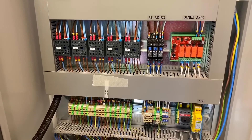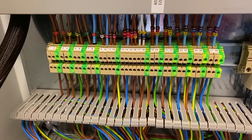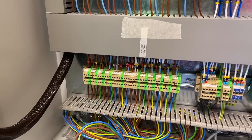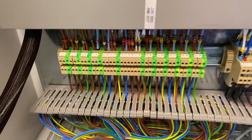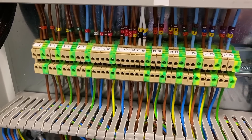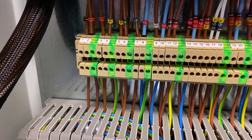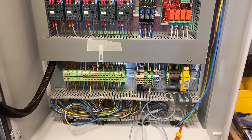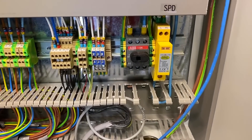What's your go-to method of installing the wiring system? Looking down here I can see our conductors are pretty logical — we've got our protective conductor, line and neutrals together. Have you not thought about putting in a separate earth bar, like we're used to seeing in distribution boards and consumer units, Eddie? No, I'd rather it this way because it's logical — that CPC is for that particular piece of equipment, pump, or boiler. It runs with it, so they're easy to find. If I was taking out a pump I'd take out the line, the neutral and the protective conductor that are side by side.